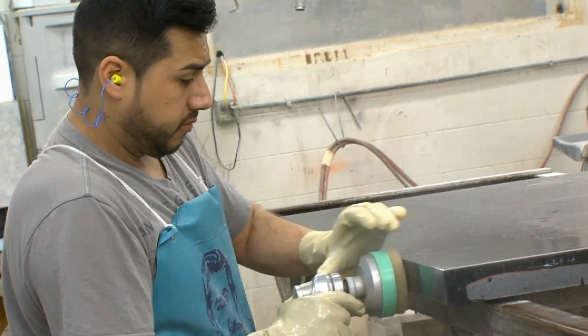Pretty much use water on everything. Water on everything. And that's mostly to save the tooling. It's really not critical on the process, but it does help smooth out that finish a little bit as well. But assuming it keeps the dust down too. It keeps the dust down. Saves the tooling, keeps the dust down. Those guys don't want to breathe the dust, so everything's done wet.